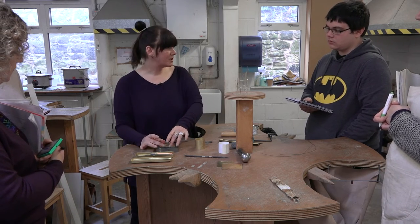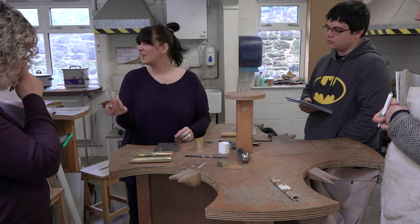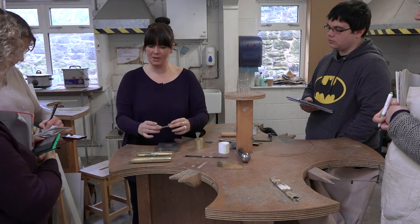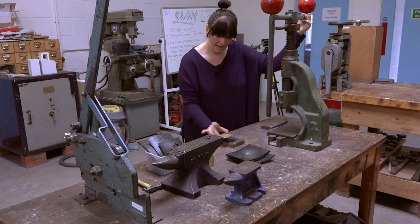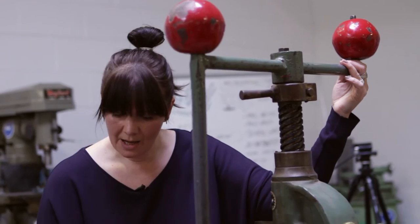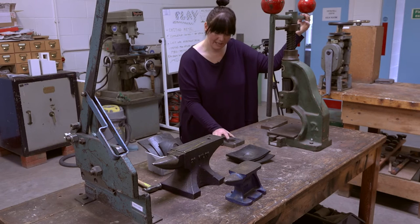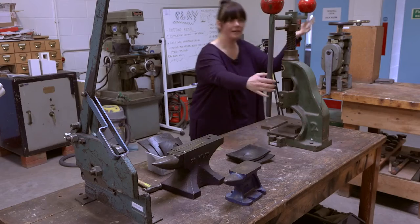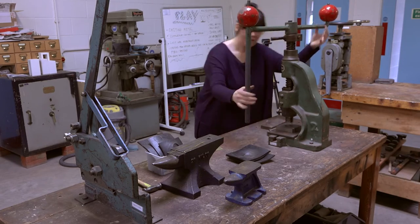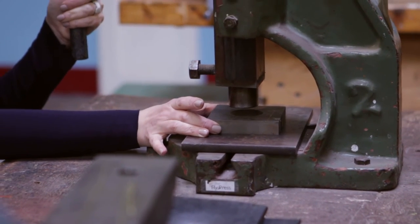Because I'm going to bring it in gradually until it matches the shape. So it's worth doing this bit first. This is pre-annealed, so this is soft. So same process as for shaping that first piece — but we've already done that. So we can go straight over to the fly press and get this base. If you had something that you want to be pressed really deeply, the metal sheet needs to be fairly thick because this is a method of forming that stretches metal. This is only going to have a shallow stretch. But I think the piece is going to be really nice to have a weighty base on it. And this is 45mm diameter, so you always want to be about a good 15mm all the way around bigger than your hole, because it's stretching it — it's going to pull it into the hole.